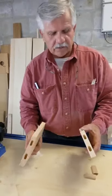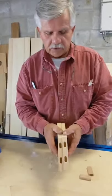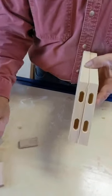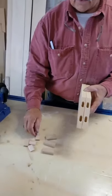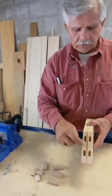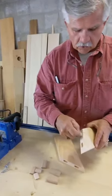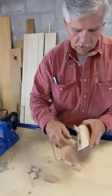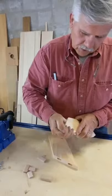One of my favorite ways to fasten a joint is a floating tenon with a mortise in each piece. The tenons come in different sizes, so you can use different materials, lengths, and thicknesses. What you would do is put glue in each one of the holes, then insert the tenon into each hole into the wet glue, a little bit on the end grain, and slide it into position.